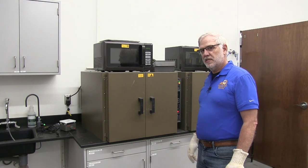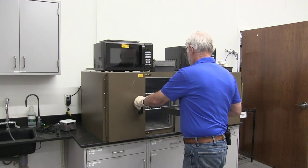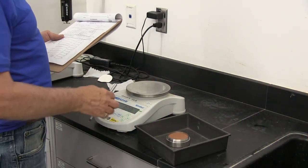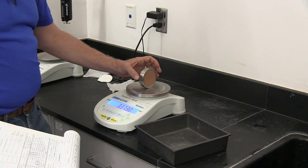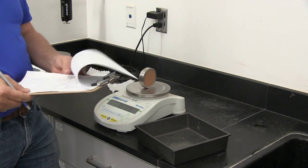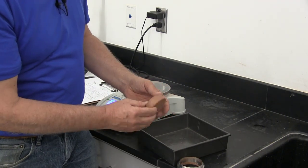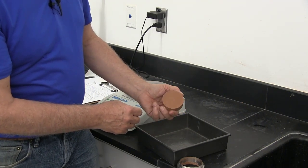It's been a day since we put our specimens in the oven, and they should be dry and ready for the water content determination. I'm just going to take these out and let them cool, and then we'll do our measurements. Our specimen has been dried out in the oven and now I can take a final weight of the specimen with the ring. If you look at the specimen here, it's shrunk quite a bit having dried out — a little red hockey puck.